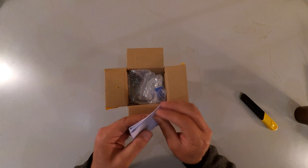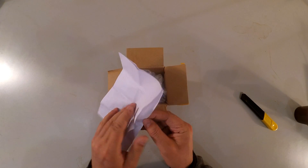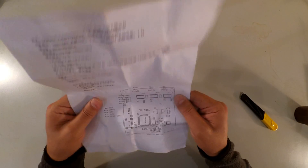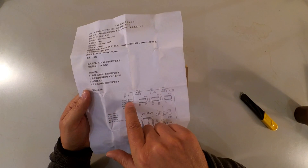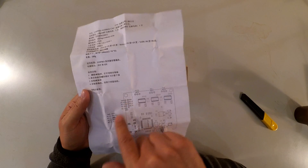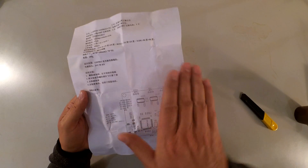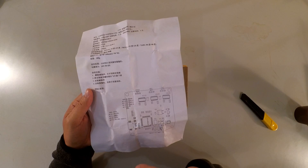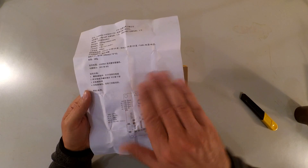It weighs 180 grams and this is the board layout. The pins I will be using are ground, RC0 for pitch, and I might set up roll as well just to make sure I've got a level. I'm not that interested in yaw. The only reason I've got a 3-axis gimbal is so that it can stabilize yaw as I use the hexacopter for my yaw control.